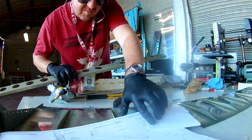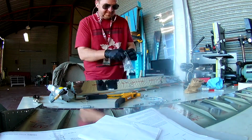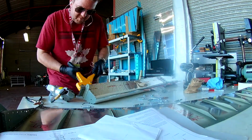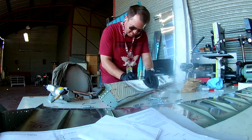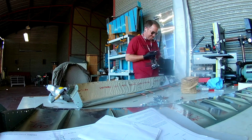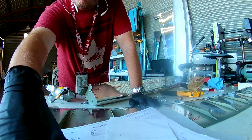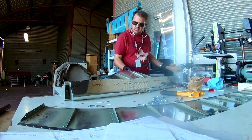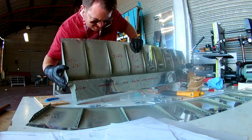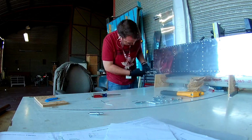So yeah, first thing you do is you rivet the spars in place, and the bottom rivets are all easy to get with the squeezer. The top rivets, it's a big, bent top of the skin, so you can only really get to the first 3 without causing any kind of warpage. Technically, I could have gotten to maybe the 4th one with the squeezer. The problem would have been, it would have definitely bent or flattened the skin. So the last 2 you use pop rivets.